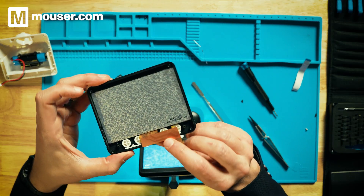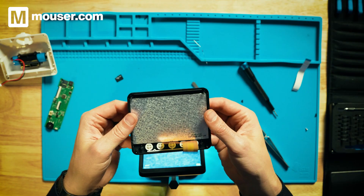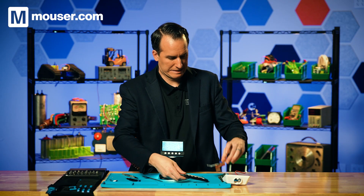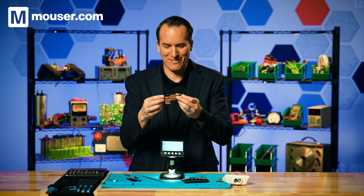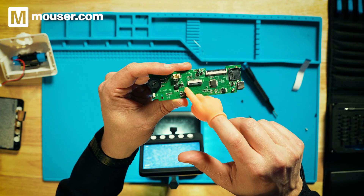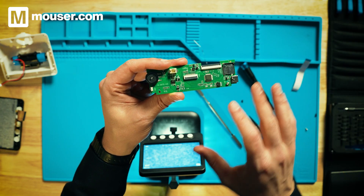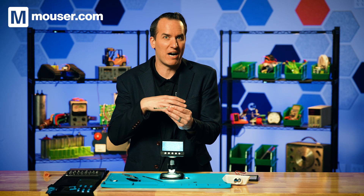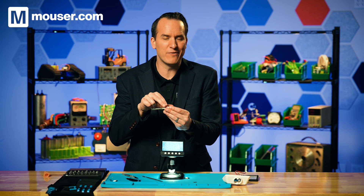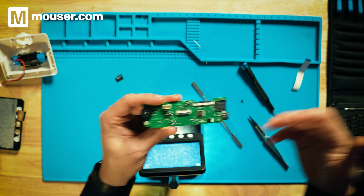And this display looks pretty new. Here's our part number — let's look at the front. Also on this board, some unpopulated component spots. This was probably in case they needed more filtering in this design. It's pretty common to design in spots for filter capacitors, even if you end up not using them, because then you don't have to go back and redesign your board if there's too much noise there.